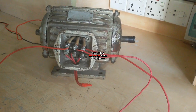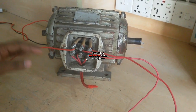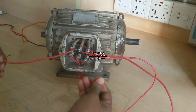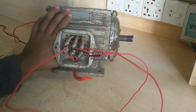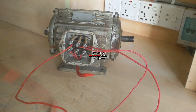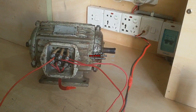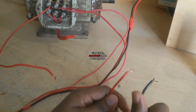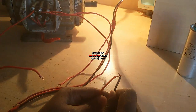Now I first select the three coils. I don't know which is which coil terminal — one is one terminal and the other terminal is shorted. Now I test the six terminals and three coils. I need a series wire. Here is one phase and one neutral. When I short two terminals, my bulb turns on.